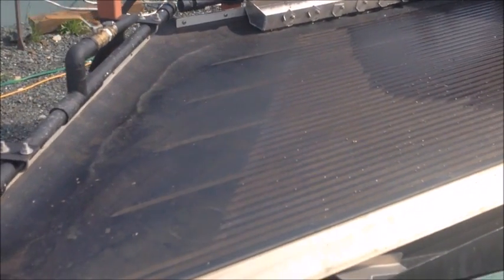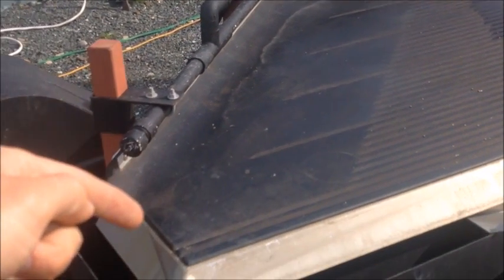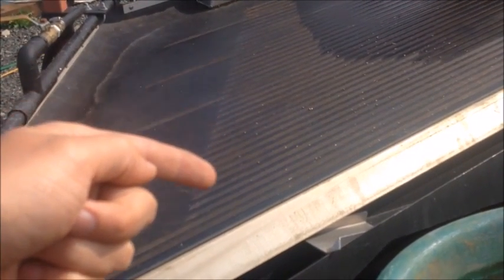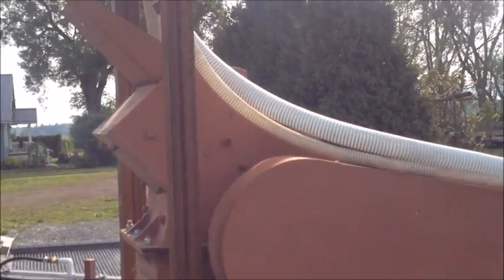All the metals and dense material are going to come across the table this way, right up under the water bar, and down to the number one and the number two high-grade. There's going to be a large band of base metals that come down here into the middlings. The plastic and fine fiberglass goes down into the tailings, but there's a sump in the bottom there that pumps it up into the hydrocyclone.